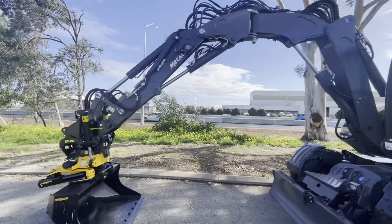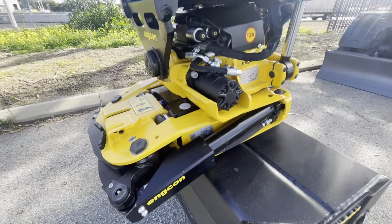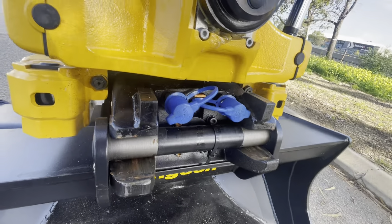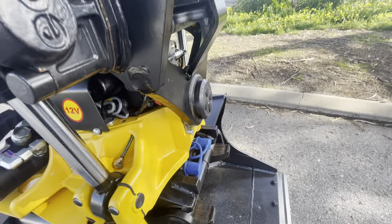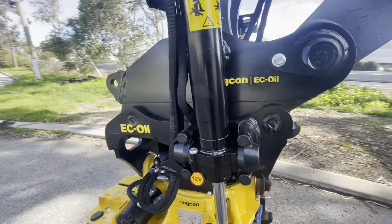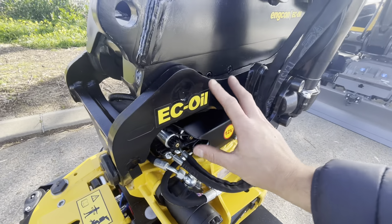So I'll come out onto the boom. Down here you've got your integrated grab — I'll show you the controls for this when we get in there. Around the front here you've got auxiliary out, so this is if you're using an attachment below the tilt rotator that you need oil for. We set everything up on yours around the outside for your post driver, etc. And then you've got your lifting hook at the back here on the top hitch, so you can lift without the tilt rotator attached.